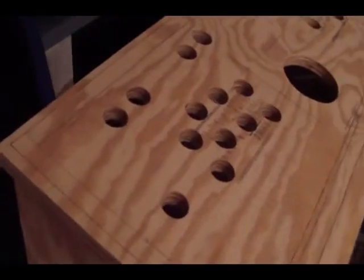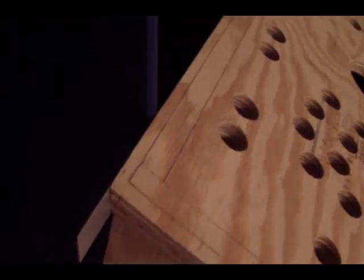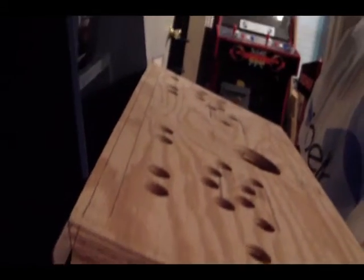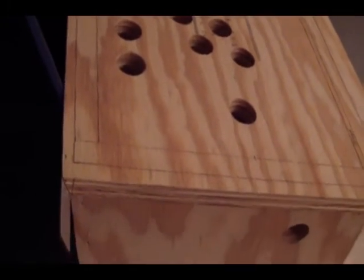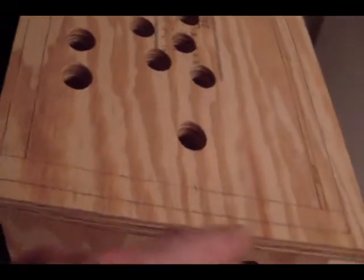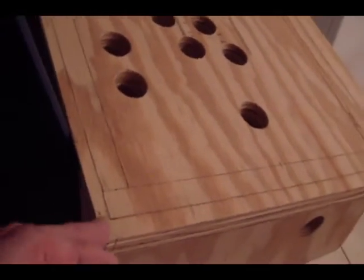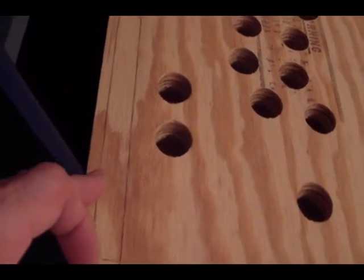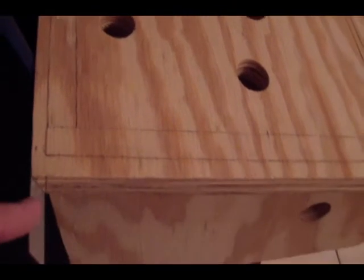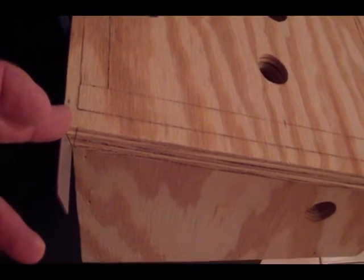And I went ahead also, if you remember, there's a thin piece of aluminum that I want to install on this angle on this bevel there, because it's going to be striking up against the cabinet a lot when it hits. I didn't do this the way a lot of people do it. A lot of people will run T-mold all the way around, and this is going to have T-mold here pretty soon, but they'll run it all the way around, and sometimes they'll come all the way in with it, and it'll be T-mold either bumping against T-mold or bumping against the side of the cabinet. Well, I'm probably going to stop the T-mold right here just because we have a bevel cut. I doubt I'll take any around the side, but I want to install this piece of aluminum,